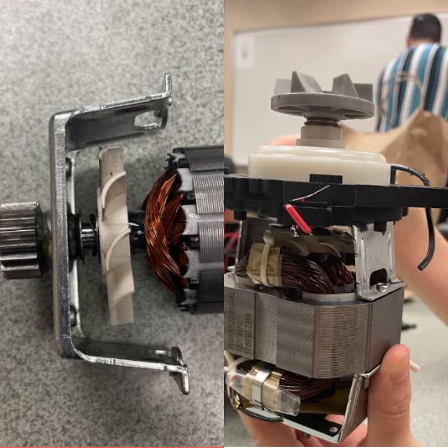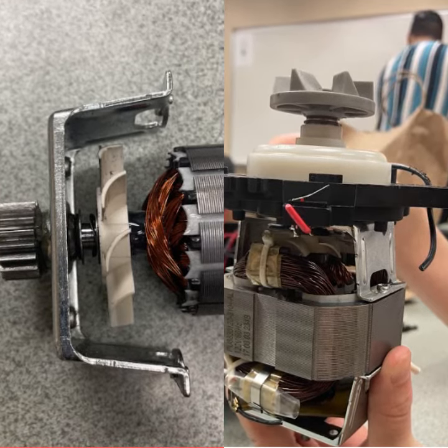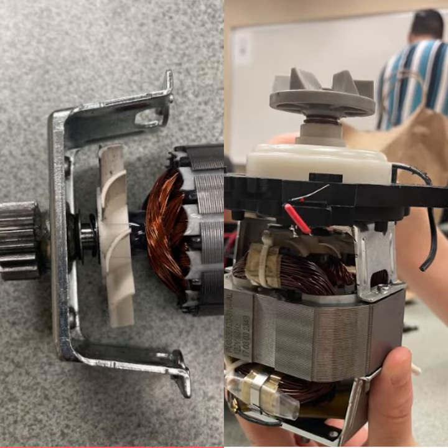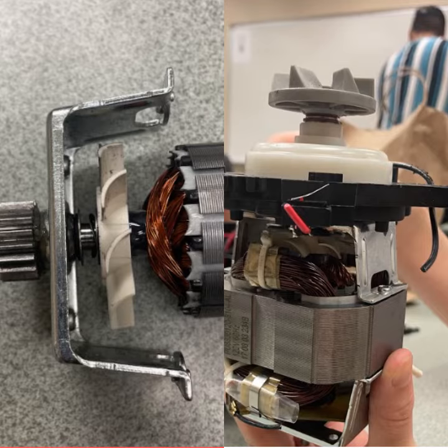Here are additional angles of the motor mount assembly. On the side wall of the bracket we can see that it is angled and that there are machining marks. These two observations further indicate that the part was manufactured through metal stamping.